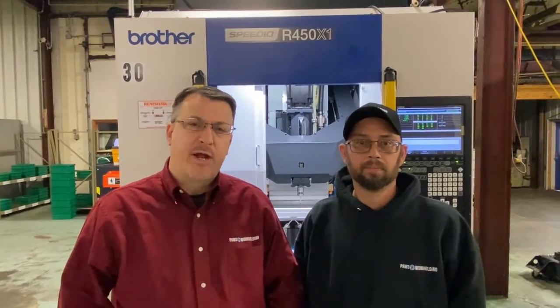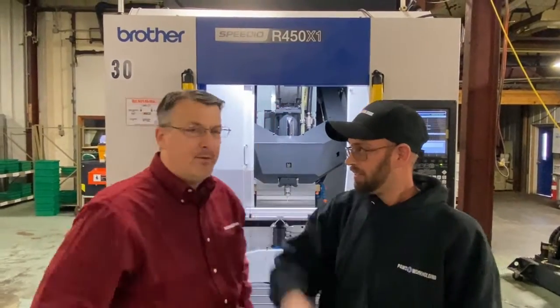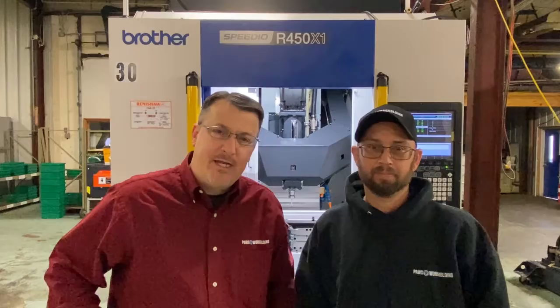There you have it. We've got the pump installed with our electrical package. The pump has basically two directional valves, two pressure detection devices, one for each pallet. It's all wired into the panel and the M-codes are working. Good job, Eric. The manufacturing team will be happy on Monday when they come in and their machine is all ready to go. See you next time.